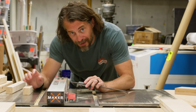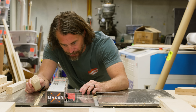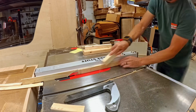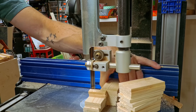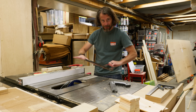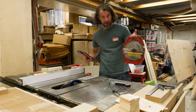So my plan is to cut some scrap 2x4 and 2x2 into quarter-inch slivers here on the table saw. To go with those splines, I also have to cut a dado in all of the sides that are going to connect to anything else, and for that we're going to use a dado stack.